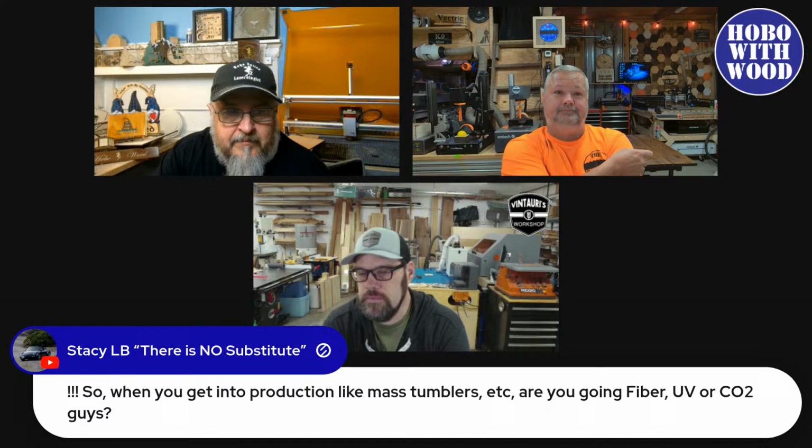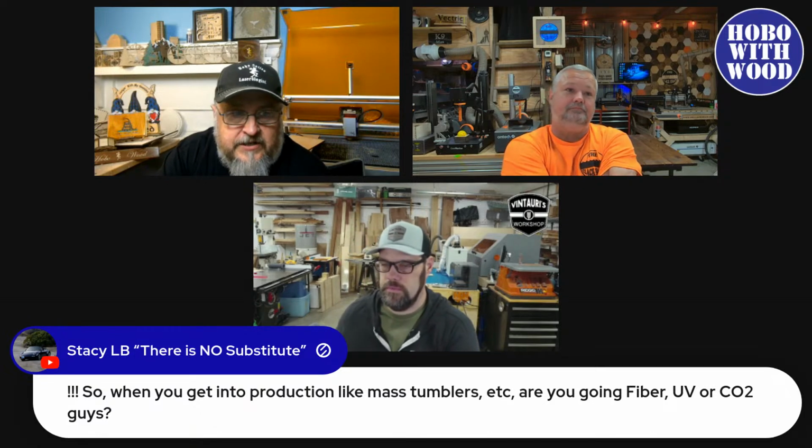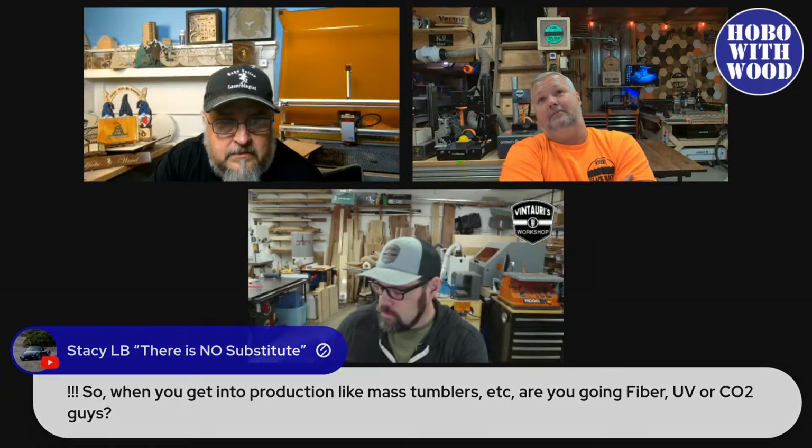So when you get into production, like mass tumblers, are you going with your fiber, UV, or CO2? I've been using my xTool S1 right now, because of the way the machine works and the workflow. I've got it set up to where everything's fixed, nothing moves. It does a good job. It's doing great. I want to get a CO2 to do them with, because CO2 is safer with tumblers and requires less adjustment, because it interacts with all color tumblers the same, as opposed to the diode, which varies from color to color. And with a diode, if you go too hot, you can turn the tumbler black or gray or cause it to dimple and sink in. So with the CO2, it's a little more forgiving.